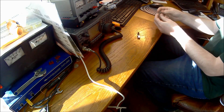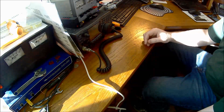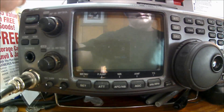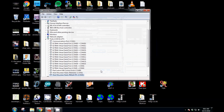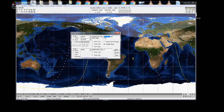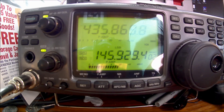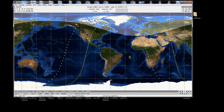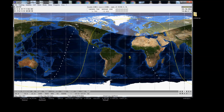Move over to the computer. I felt so good about my repair that I figured I'd just put the case on, pop the case on, grab the cable, plug it into the PC, and start up the radio. This is my ICOM 910. It came up as COM30, which was going to be a problem in the software, so I jumped into the settings and changed it — I forced it onto COM3, which would work better. I've got lots of COM ports and virtual COM ports from my Flex Radio. Unplug it, re-plug it, make sure it comes up as COM3, jump into the program, set it for COM3, restart it, then go over to the radio. Got it tuned up to a satellite, enabled the tuning, and saw that the radio does change frequency on both bands — so that means the repair was working good.